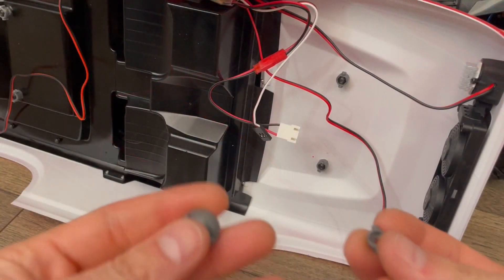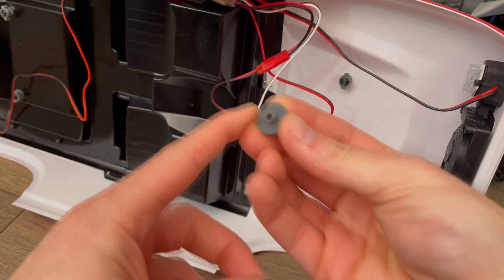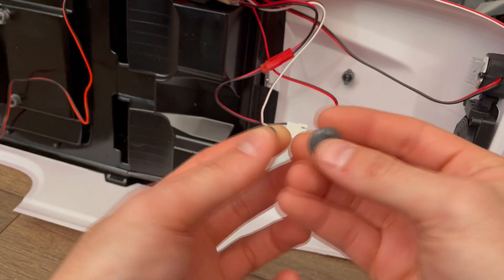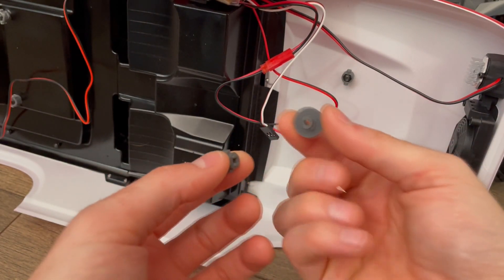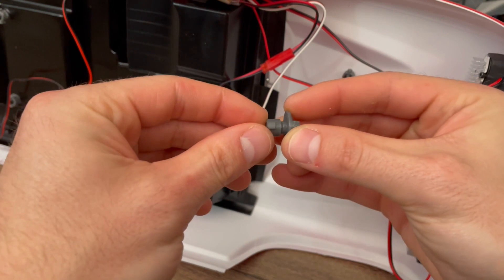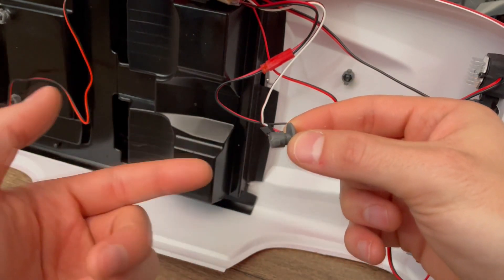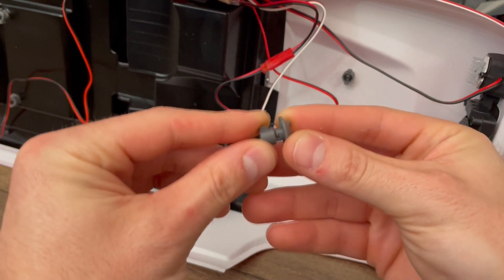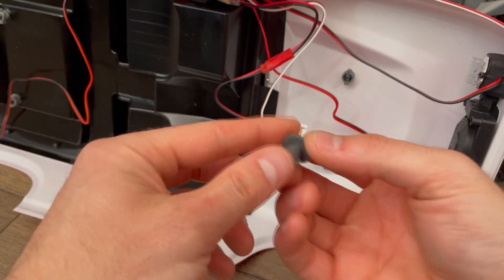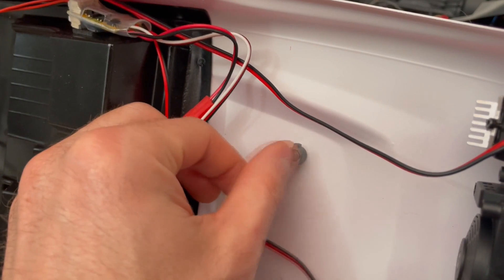When the pieces are separated, you have the top side for the body — it extends a bit and has a keying mechanism. On the underside, this is where your M3 lock nut goes in, and it has a similar keying feature. When you place the M3 by 12 screw through the body, make sure these line up and mesh together. The strakes line up with the pieces on the underside to control rotation and alignment. If they're not lining up, carefully twist until they drop and lock into place — you'll feel it. Then just tighten down until the bolt just comes through the nylock; don't go much farther past that.